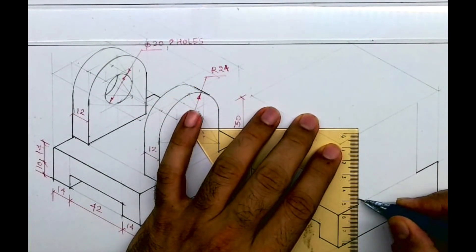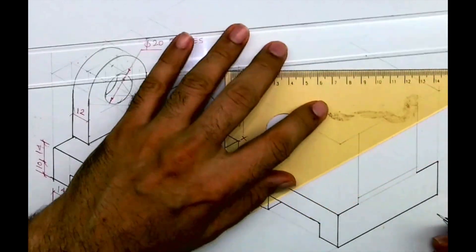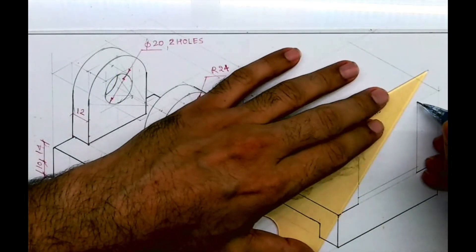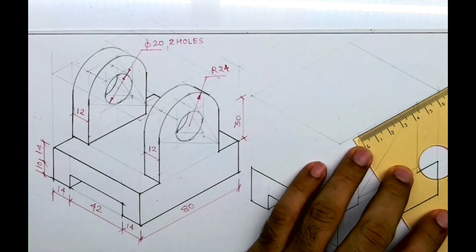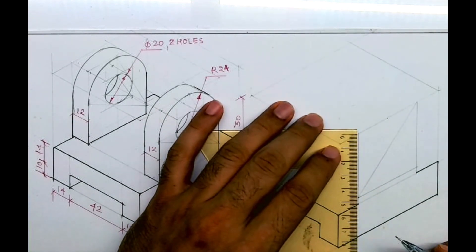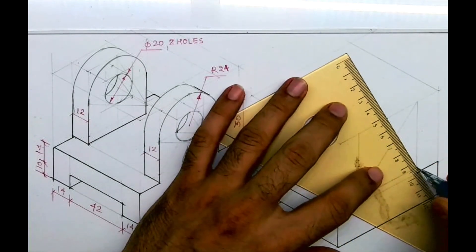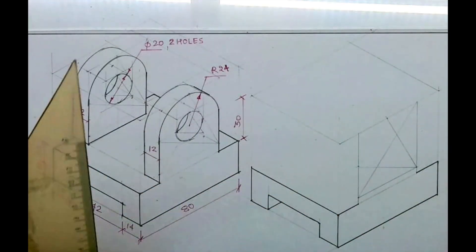From here I can mark 48, because we need to draw a rhombus — diameter is 48, radius 24. We can mark the longest diagonal and then mark the midpoint at 24. Same way here also we can mark the midpoint and join to the opposite corner.